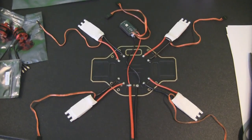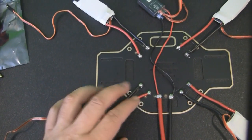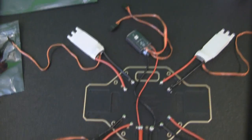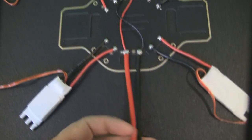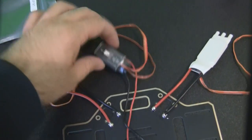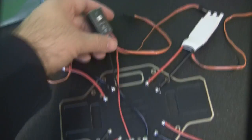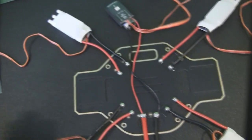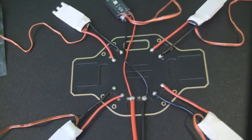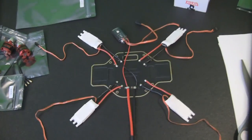I've finished soldering up the bottom board. I added the ESCs — they solder right onto the positive and negative contacts, one for each of the four ESCs. There's also a contact for the battery lead and you connect the positive and negative contacts of the power supply for the Naza board. So now all I have to do is put the frame together, then plug everything into the controller and receiver, and we can get it set up.